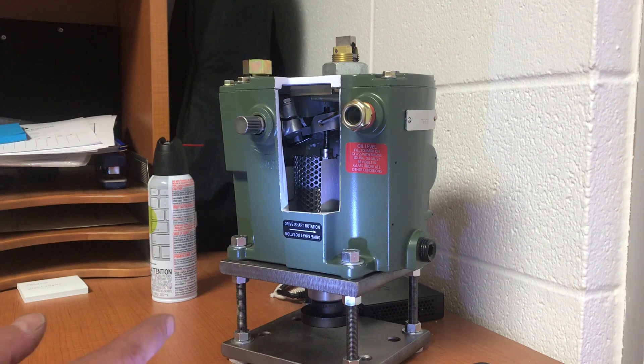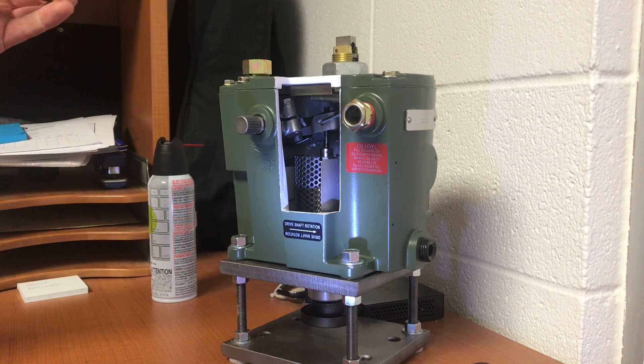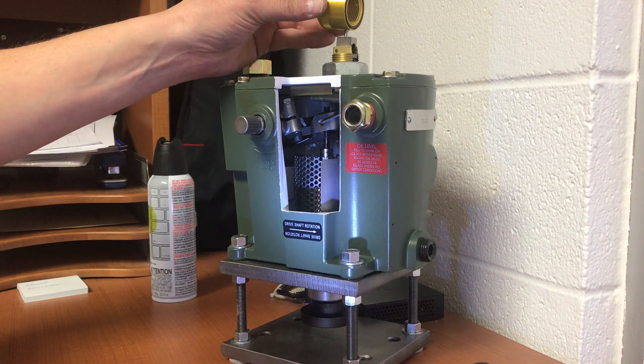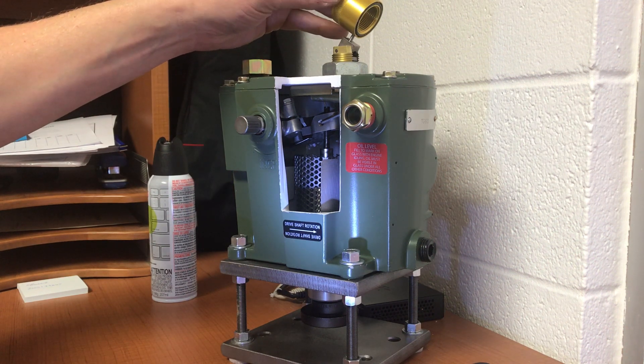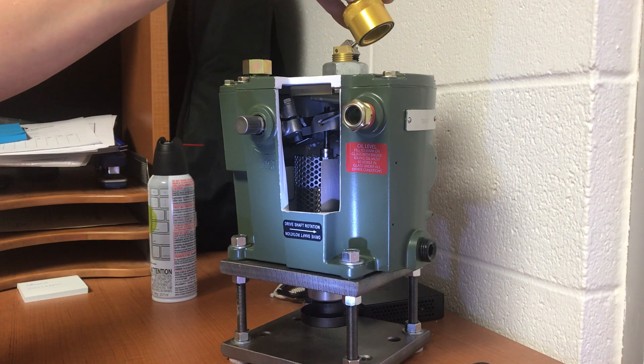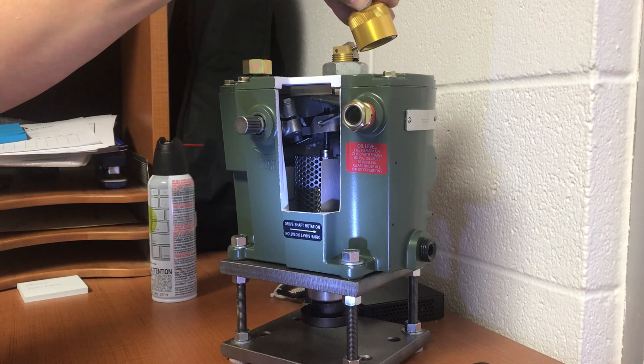Your turbine is running down, so you push this down, pull the key handle off, put it back up, and run your turbine down. You're going for your second trip — generally you do three or four trips. The next time, all you'll have to do is slowly actuate this to get your second overspeed trip.